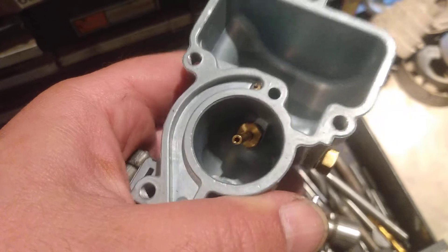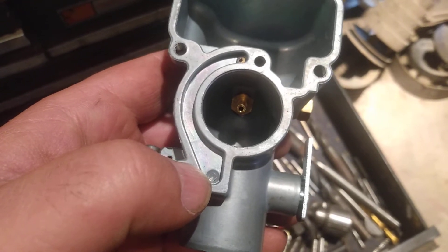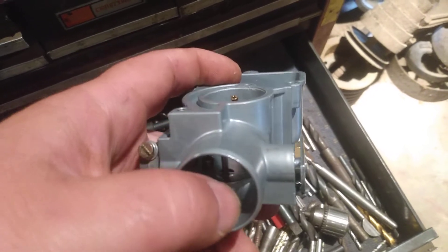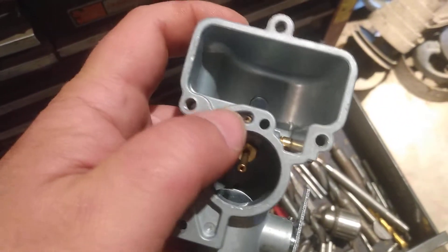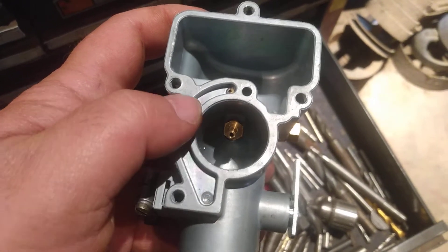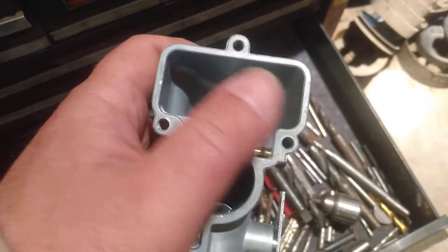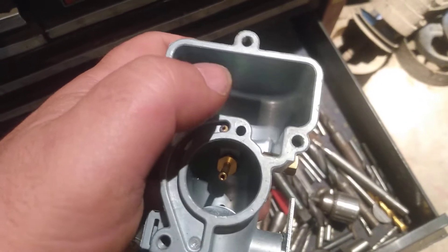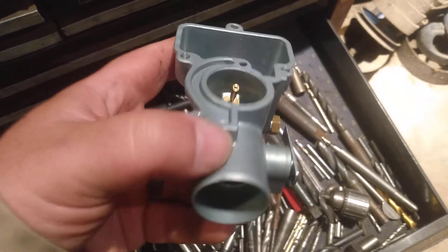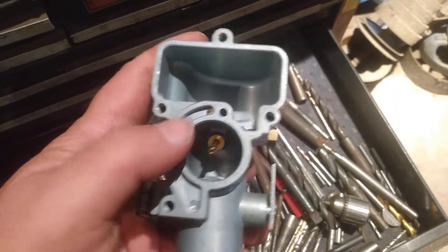I was having trouble getting my Cub to start, and I found by looking at photos of original Farmall Cub carburetors that this hole was not drilled through from the air intake here — the air horn. This is a vent passage for the bowl, and this air bleed hole right here. With this plugged off, there's no air being drawn in through this channel, either to this bleed, or to connect the float bowl. There's a passage in the top casting of the carburetor that connects this space to this channel, and from this channel it's supposed to connect to the filtered air inlet of the carburetor, so that this is equalized to atmospheric pressure. And this hole was not drilled.